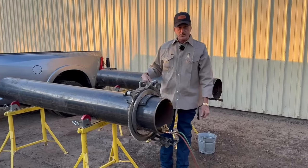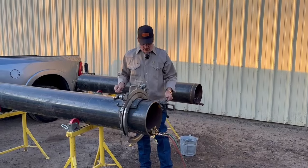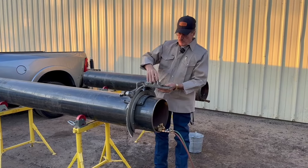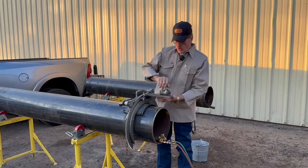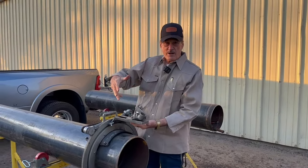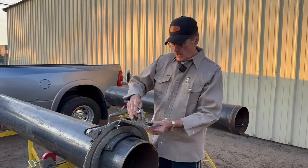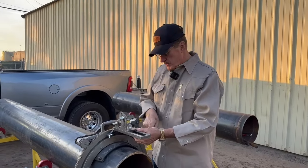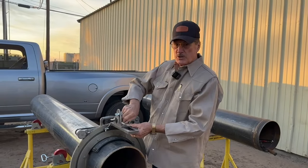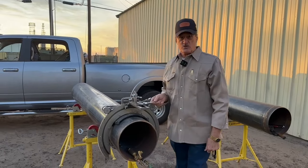You go around the pipe once you get it hot. It has a bridge here, and this piece right here holds your torch. You can turn it around to back bevel, or bevel forward — put a 30 or 37.5 degree bevel, whatever you want. It slides up and back for adjustment, for whatever distance you're cutting. It's real easy. You don't want to put a wrench on this — if you do, you want it to be a baby wrench, because this stuff's made out of aluminum and you're going to strip it over time.